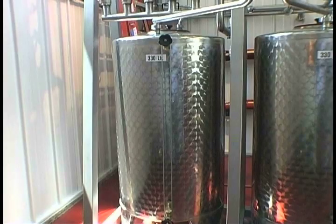First part of a distillation run is called the heads, and it's very high in alcohol percentage, but it's very low in character. It smells a lot like paint thinner most of the time. If I hand you a bottle of it right now, you'd instantly know, based just on the nose of it, that you wouldn't want to drink it. So we separate that out.